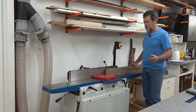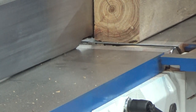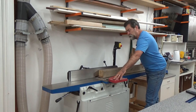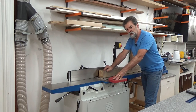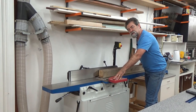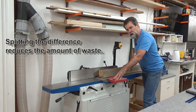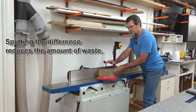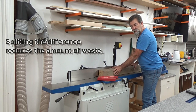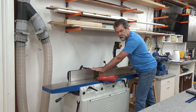This is that piece of cypress pine that I've just docked, and you can see she's got a fair bit of rock. I'm looking at that and thinking if I take it all off one end, I'm not going to take it off the other end. So what I'm going to do is have a look at the amount of rock there and try and halve it by eye and by memory from doing this stuff for a while. I'm not going to push it hard up against the fence at the moment — I'm going to halve that rock and then I'll be pushing down.